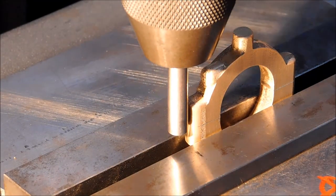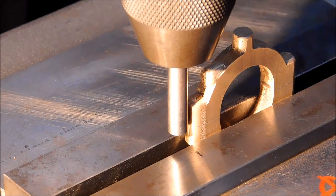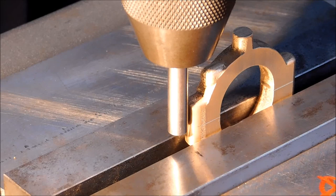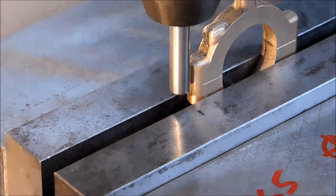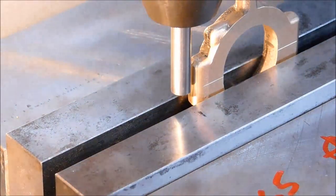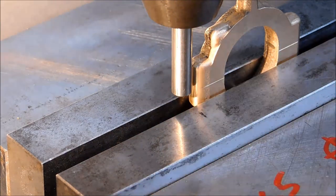Okay, when in doubt, stick something to the back of your machine with a powerful magnet, and that gives you a great silhouette. Nice bright background for whatever you're trying to see, and light that up instead of lighting up the part. And now you've got an incredible visual right through that crack.